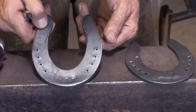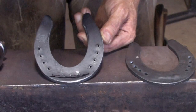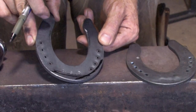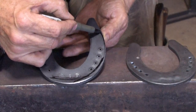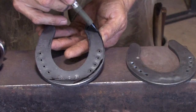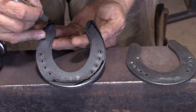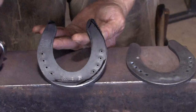This being the outside, I'm flipping the shoe over. The first thing I'm going to do is knock the rocker toe out of this shoe because on this particular horse I do not need it. Then I'm going to leave the medial toe full because I do not want the medial toe when the horse stops to descend into the ground — if it does, it's going to cause the horse to spread. Then I'm going to forge the medial heel to put a radius in it and push the center of this branch over to the middle, because this area is where a lot of reiners step on plates and pull them off. I want to push this over but not go underneath the foot. Then on the outside I'm going to take about three eighths of an inch off of length, so this shoe will sit on the foot and be longer medially than laterally.